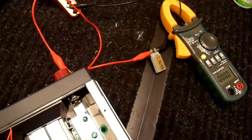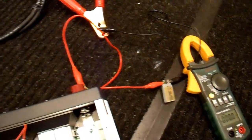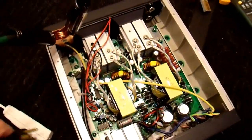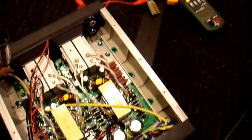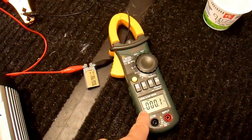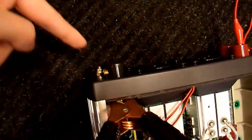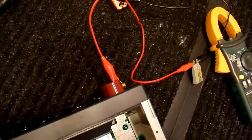You can also connect it up to a battery and use some sort of current limiting device. Some people recommend a light bulb — don't do that, it doesn't work. You can also buy power supplies that have adjustable current limits, but I'm not going to do that because I have this setup and this will work just fine. So I have my amp meter clamped onto the input power terminals. The negative side I just have clamped to the negative terminal inside this case, and this one is connected on the positive side through these alligator clips.